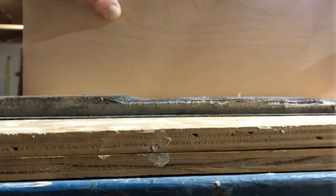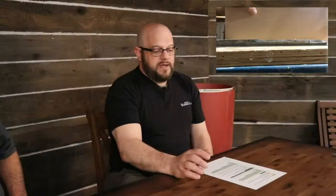Our second picture is titled 'Platen Issues.' For sanders that use a platen on the final head, a common problem is faint streaks at the end on your workpiece. If you're not taking care of your platen — the graphite roll that covers it or the felt underneath — that can create problems. Most modern machines use felt wrapped by a graphite strip. You should never ask a platen to remove more than about two thousandths of an inch, and it needs to be used at 150 grit and above, generally 180. If it's 120 or less, don't bother with the platen.